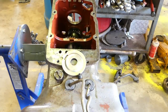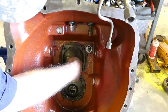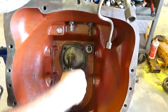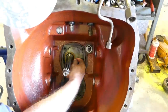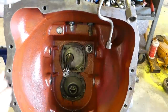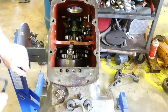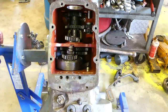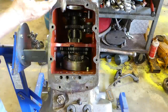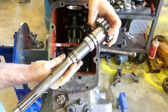This front snap ring, or front oil control ring, off here. Then the thrust bearing, or the thrust washer, coming forward. Can you see that again? Sort of. That should let the shaft come out. And that's where the sealing rings were. That's in good order. No problems there.